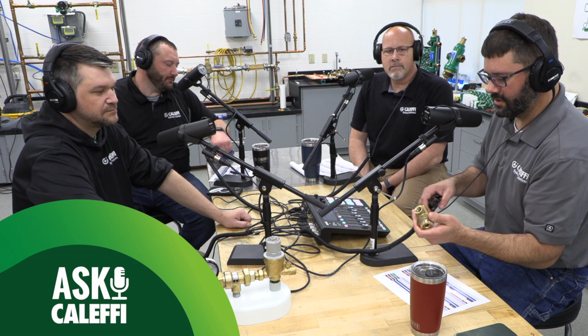Now with ours having Posi-Stop in it, the rubber seals, you just break the unions and swap it. But if you don't have another one on your truck, all you need is to break it out of the unions. And the spot where it leaks is between the first and second check, right over the vent. And it might be just a little piece of rust. It could be a chunk of thread tape that finally made its way there. It could be a couple grains of sand. You never know. But all you have to do is take that downstream check out right here.